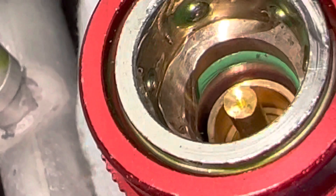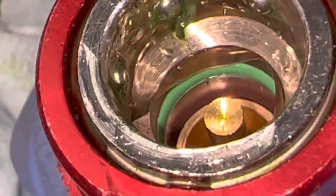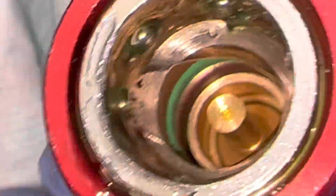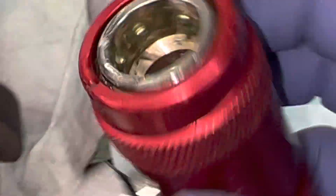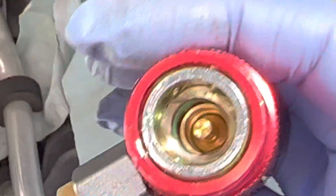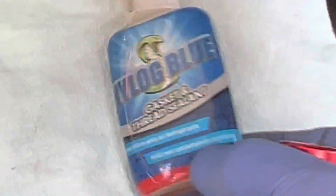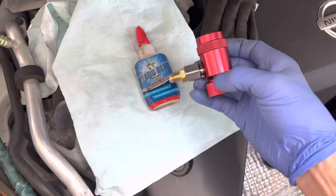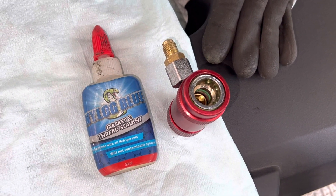You can see it's just starting to hit the o-ring. If this was an 80 or 90 degree day, it would have already coated the o-ring. You clean it off first — wipe your fingers or a towel around to make sure it's clean — and then when you slip your o-ring over that surface, not only is it lubricated, but vacuum cannot pull through this product. This prevents vacuum leaks, not pressure leaks — vacuum leaks. A subscriber asked the question and I answered it in a video.